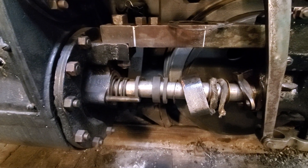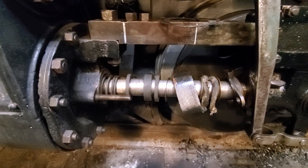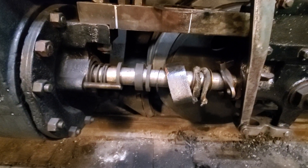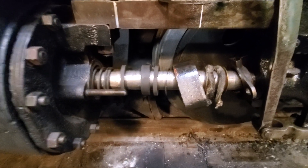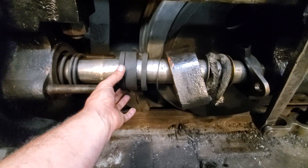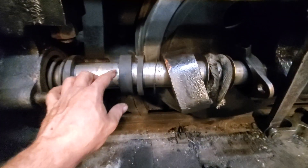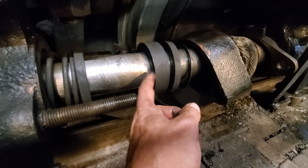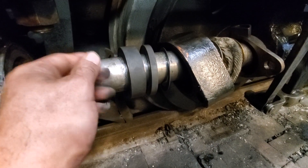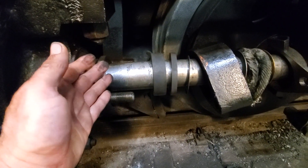Having the offbeat exhaust, I'm thinking I wonder if it's not valve timing as much as it is just that the cylinder is not developing pressure because it's all being blown out through the packing. So I tore this apart to look at it. Let's identify what we have here for components. Starting all the way in, you have this spring, and it fits in the head. Then you have this ground metal washer — it's got a ground surface on it. Then you have the actual packing itself, and in here are two pieces of Babbitt that are like half moons, and each one has a flat spring behind it.